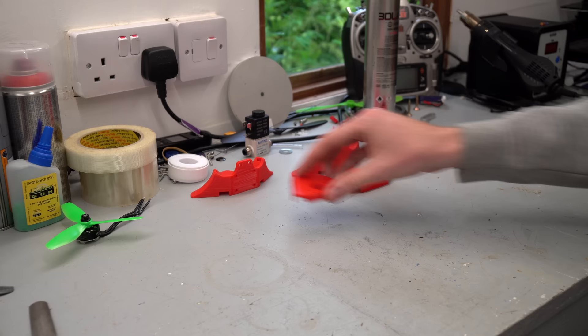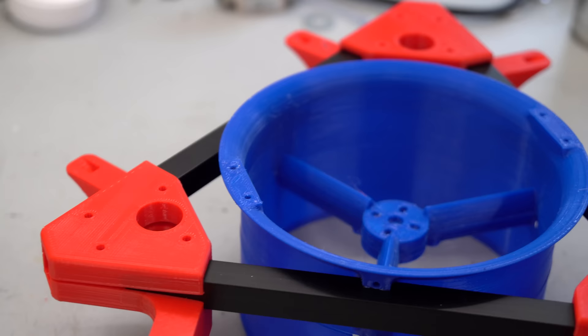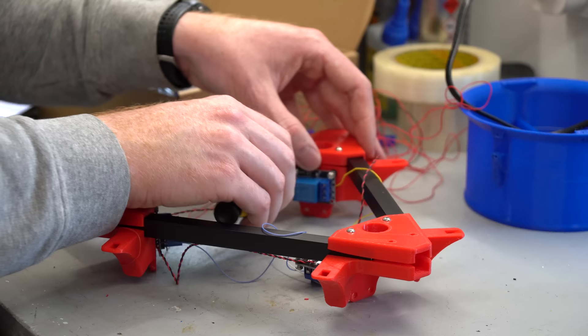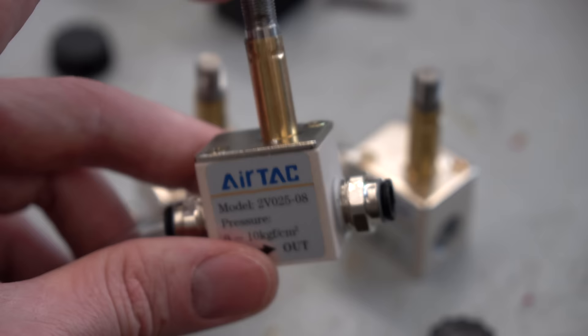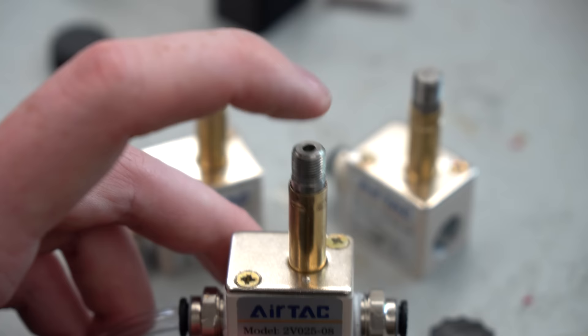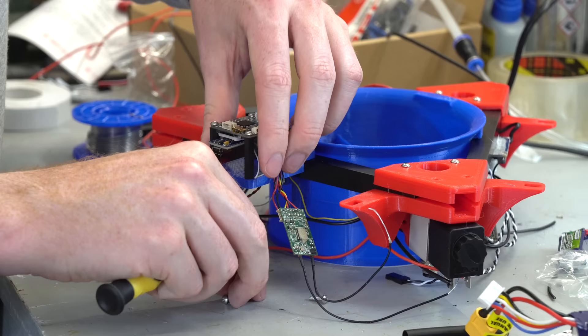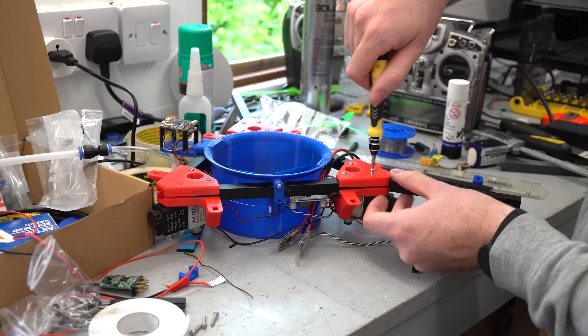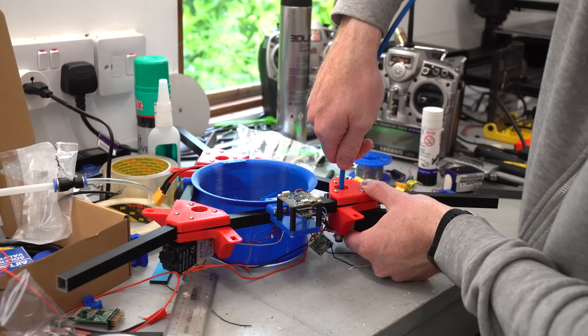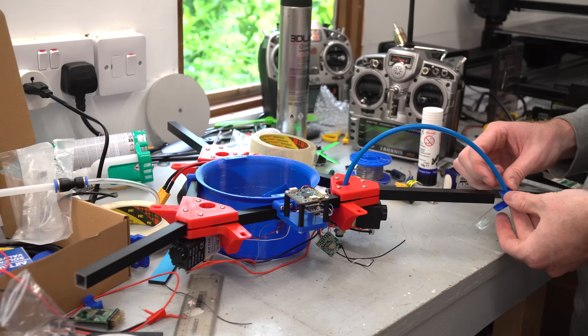The frame parts consisted of a few 3D printed PLA parts — supplied by filament sponsor 3D Prints UK — as well as some aluminium spars, which when assembled created a triangular frame around the centre duct. Then I mounted the electronics, starting with the relays that apply power to the valves, then the valves themselves — one of which weirdly had a hole in the top that would leak air, but the leak was very slow so it shouldn't be an issue. Then came the flight controller, Arduino board and RC receiver, which allowed me to actuate the valves from my controller. I then mounted the arms and temporarily attached the nozzles using tape in case they need modification later.